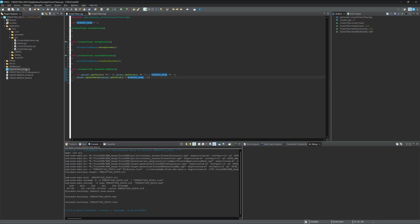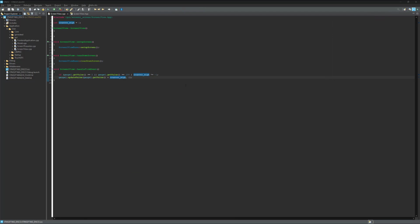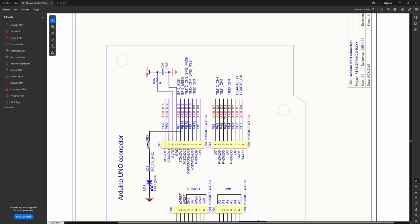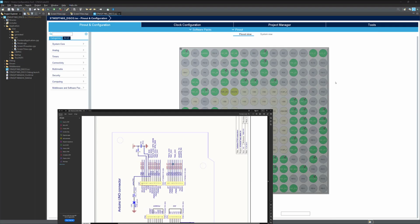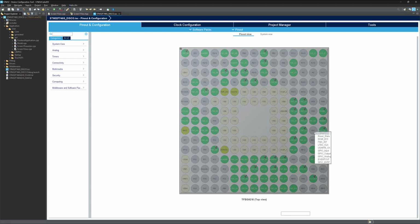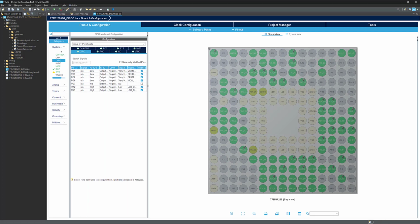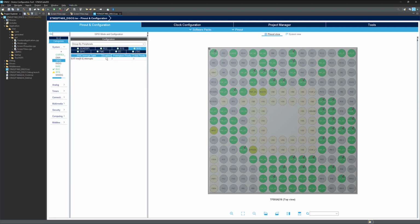For this purpose, you need to add a GPIO as external interrupt. I'm going to assign the G7, which shows in the header of the board as D4. Define the GPIO as external interrupt and enable the interrupt. Now save this code.